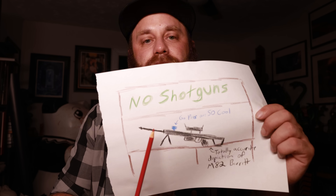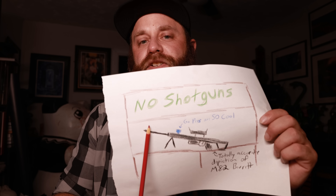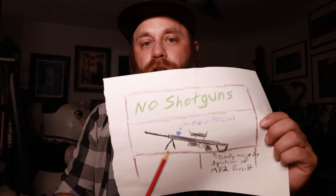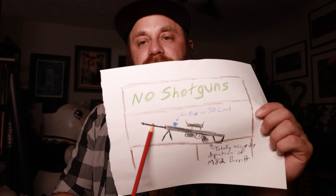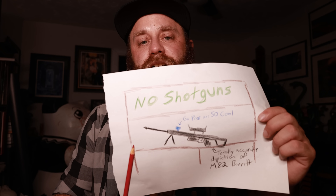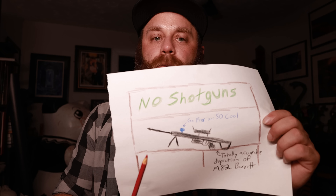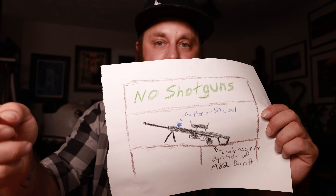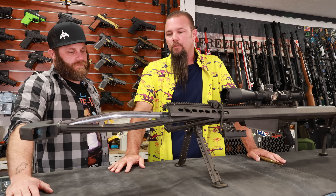Once fired, that dimple caused the gases to stay trapped in the barrel just long enough for them to rupture at the fractures. We know gas was the cause of the break because the rifling inside the barrel is 100% unscarred and the muzzle brake is completely intact, which means our round made it out of the barrel and downrange.